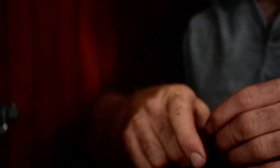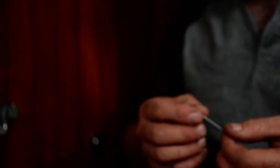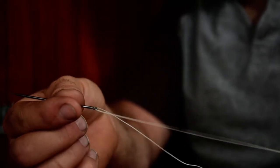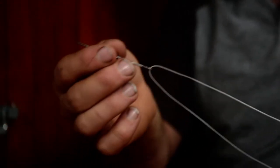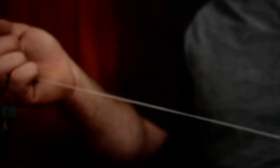You just need a small sail needle, available at any chandlery in small packs. I've got some Marlowe number two whipping twine — you want it to be waxed, either pre-waxed or waxed yourself with a beeswax candle. It helps the lay of the twine stay together and lubricates it while stitching. I thread the needle and double back the twine, which makes the whipping go twice as fast since this is quite thin twine — about five feet total.